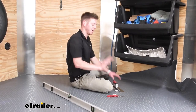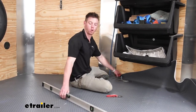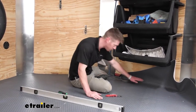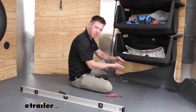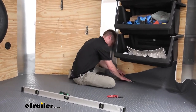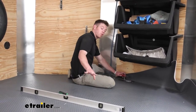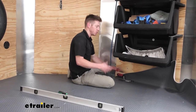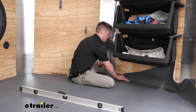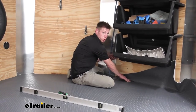One tip when you're cutting: it comes in handy to have some sort of flat edge — something small like this for the corners, or something longer for the longer runs. The idea is to get the flooring as pinned into that corner as possible, so whenever you make the cut it's going to be right in that corner and it's going to be a straight cut. On the longer ones it's nicer to use a longer straight edge because it's not multiple different cuts and you won't see as many differences in the line.